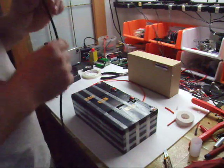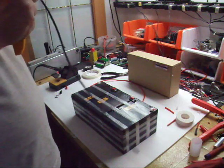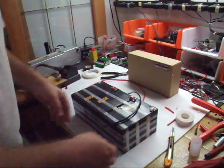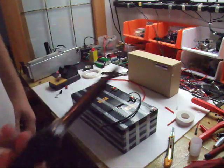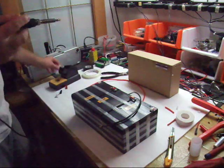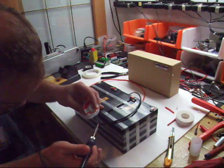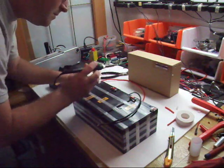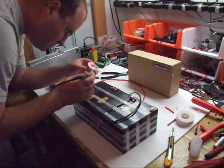At this point I'm ready to take — this is 12-gauge, fairly thick stuff, good enough for the 30-amp controller we're going to use. Let's strip back some strands. Now, working with a solder iron, always make sure your tips are clean. I added some solder on it last time I used it and it's all full of crud, so I'm just going to wipe that on a wet sponge — nice and shiny. Then add some solder to my tip and solder on the cable.